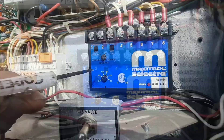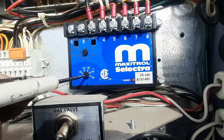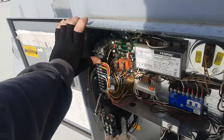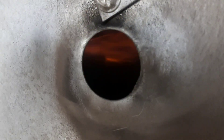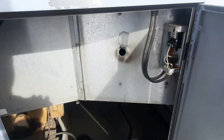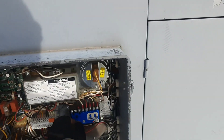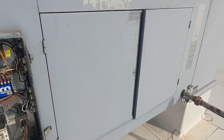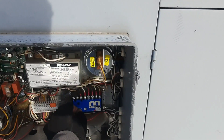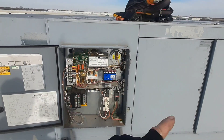The selector here looks like it started to kind of back off. Let's adjust that down — let's say 130-ish — and then we'll fire the burner again. So that burner's still lit right now and modulated when I back this off. You can hear the burner modulate when you hit it. This is what the supply temp we're trying to maintain. So now we know the burner works.